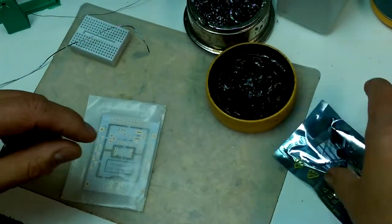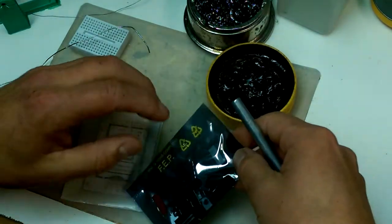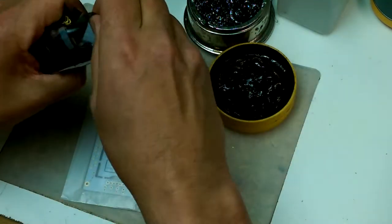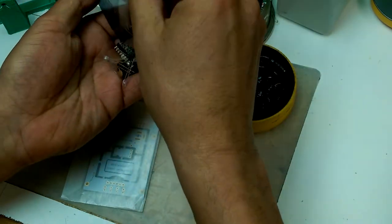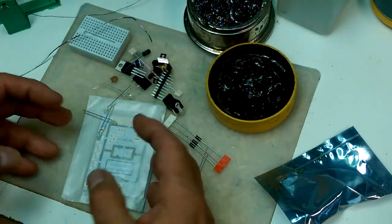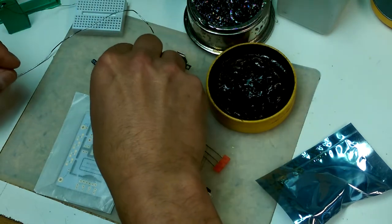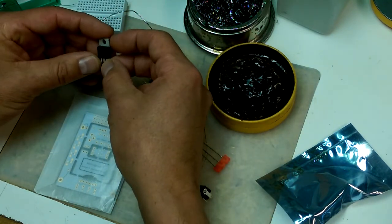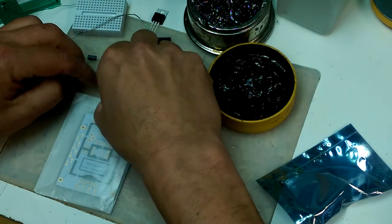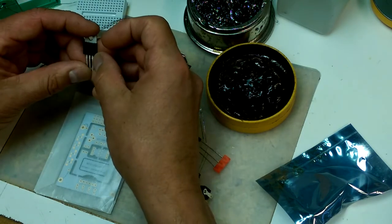Okay, so whiteboard. What do we have in store for us? We have a power supply that is probably going to be based on an LM317 voltage regulator, so that you can put power into it. And yeah, so there's that. Some diodes for protection, some LEDs for indicating what's what, a battery holder, and a pin header, LM317 voltage regulator, and a trimmer, probably to adjust the voltage out. Is it an LM317 adjust? Yeah, I think it is.